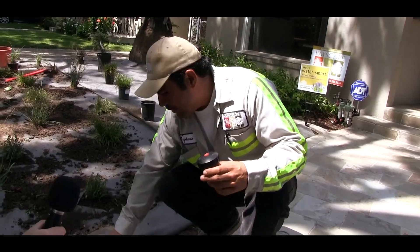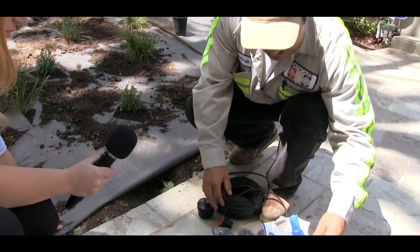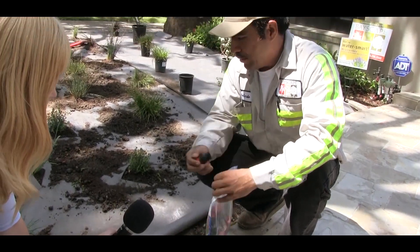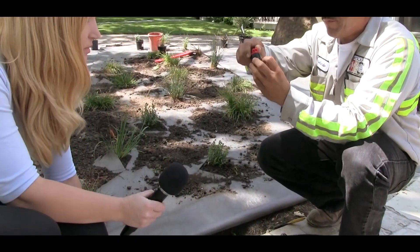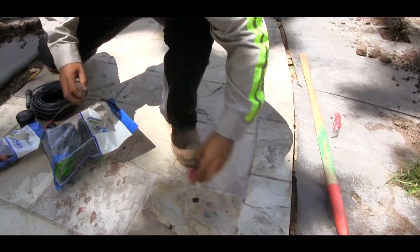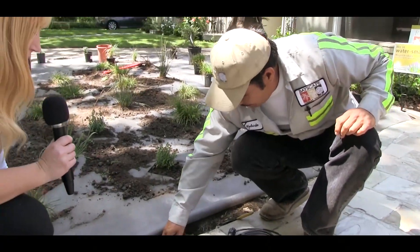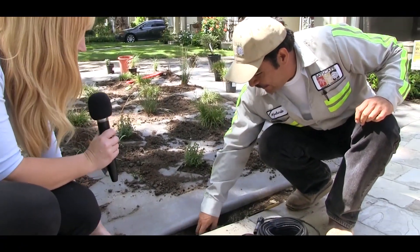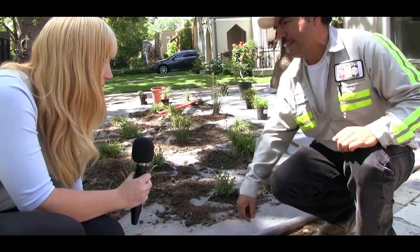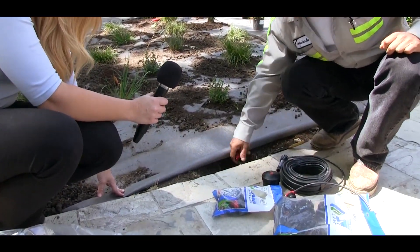What we call an octobubbler is what we're using in the drip system. We find a point of connection, then we start one of these. For this section, we need a small one — a quadribubbler. This used to be a pop-up sprinkler here, but we took the sprinkler out and converted it. We remove the sprinkler since we don't need it anymore — now we only need an adapter and the quadribubbler.